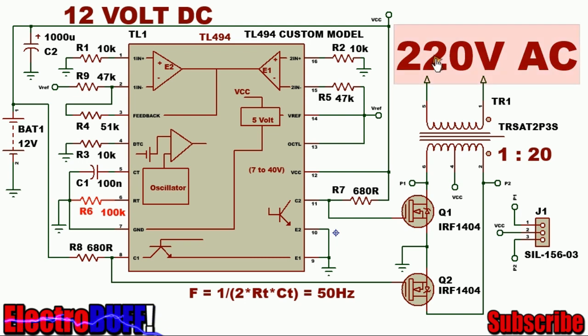It should be rated 220V to 12-12V. The transformation ratio can be 1 to 20 if you want 220V. I recommend this because when you connect the load, there will be a slight voltage drop, which will ensure that the voltage does not go below 220V, since this ratio will give you about 240V.